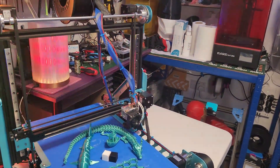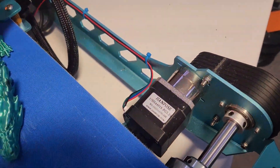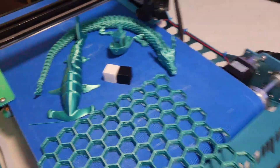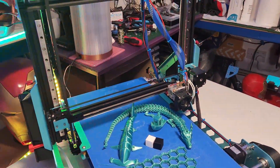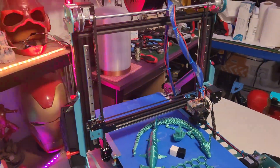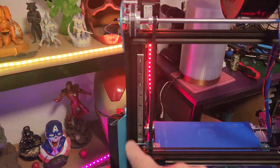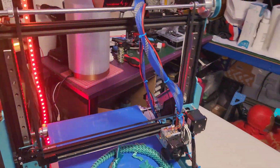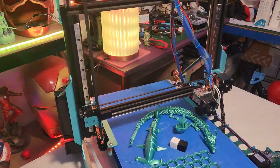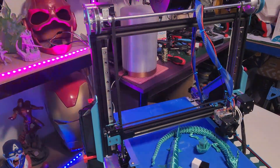It has a double-driven motor with a 5-to-1 gear ratio which moves the belt forward and backwards. It has linear rails on both axes — X and Y. There are adjustable belt holders on each side, and it also has a filament runout sensor.